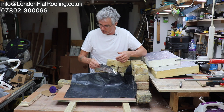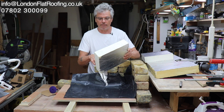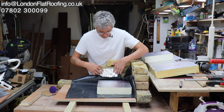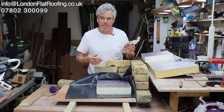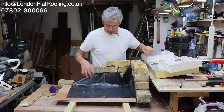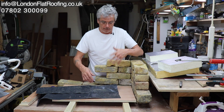Sealing to the walls is going to be really hard. I just had this hanging around — a bit of silver foil we would normally use for vapour-sealing the insulation — and again the manufacturers are so misleading: they say you can use this as the vapour barrier as long as you seal it from underneath. But can you imagine people on site trying to do this? Going around sealing that right is not the best way. I've never ever seen anybody try and seal this vapour barrier to the wall, and the reason you want to seal it to the wall is so moisture can't come up from around all those cracks and get into the roof makeup.